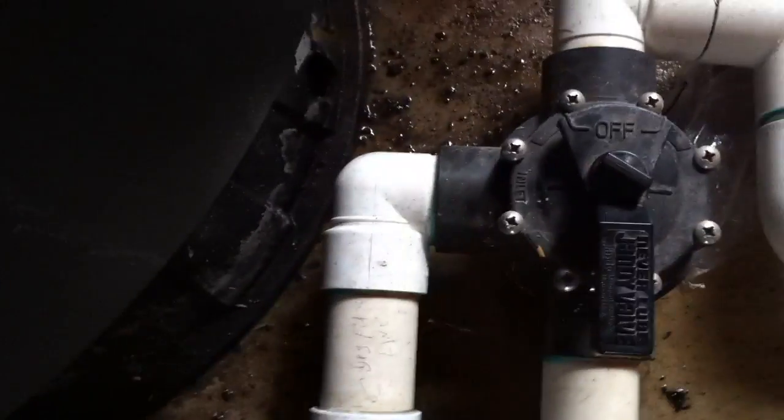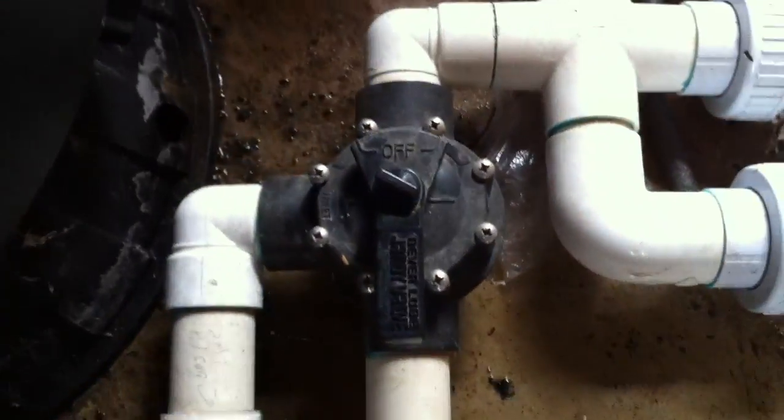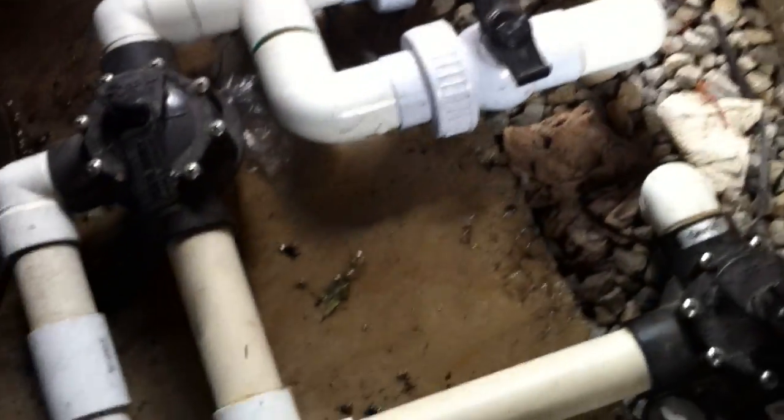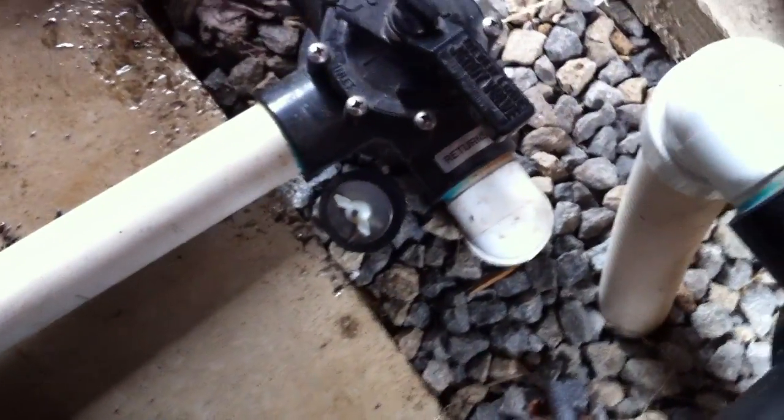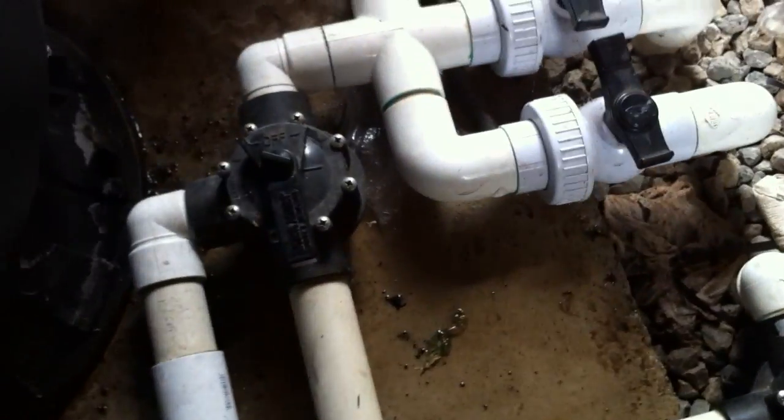And we come back out of that unit, and we've got a hard street elbow right into a three-way diverter valve into a return manifold. I believe those three there are probably going to go to a set of laminar deck jets — that would be pretty normal because they're currently in the off position. People hardly ever use those deck jets. And then this is the actual return side to the pool: one side to the steps, one side to the pool returns itself. That flow restriction right there has got to go — definitely making the system work pretty hard.